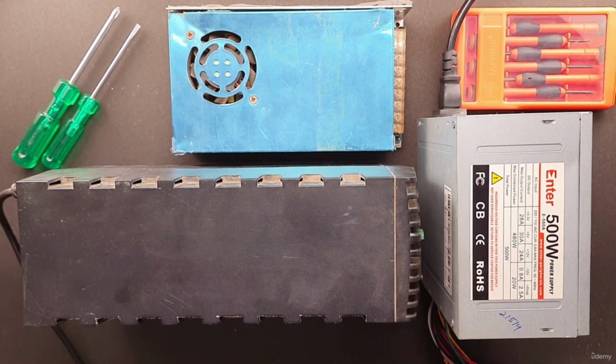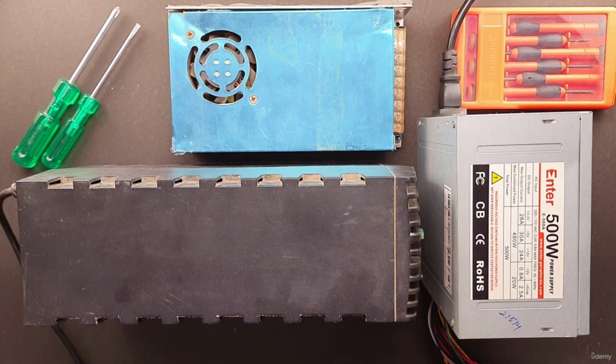Firstly, always disconnect power before taking something apart. This is true with battery operated products as well as AC powered ones. Even if there is no danger to you, you have a much higher chance of damaging the device if power is connected when things come apart, whether the unit is turned on or not.